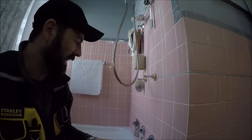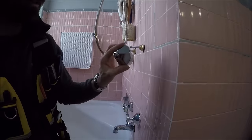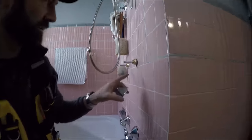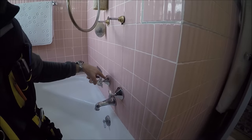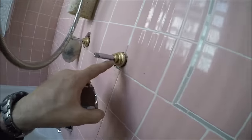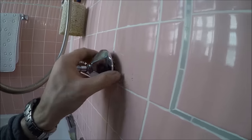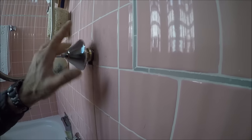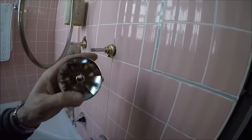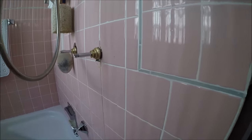Just about every project that I do, there's always a hitch. You get to the very end or somewhere along the line, a simple project turns into a little bit of a pain in the butt. These escutcheons are a little bit different than the old ones, and you can see how far this valve sticks out of the wall. These bottom two were recessed in enough that the escutcheons fit. So this stem threads into the actual packing nut. What I'm going to have to do is trim these down and get them all filed so that they still thread into these brass nuts here.